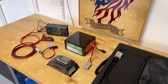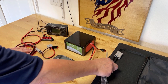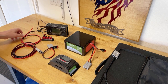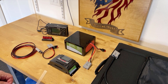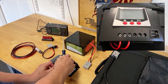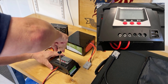We're close to the finish line. We have finished our cables. The first cable that we made will go into the battery terminals on our charge controller and connect to the battery. The second cable that we made will go from the solar panel into the solar panel terminals on the charge controller. Then we'll connect our battery to our distribution block and power our equipment. We want to connect the battery first — let's start with connecting our wires into the terminals of the charge controller. Make sure your polarity is correct, as this is all clearly spelled out on the front panel of the charge controller, which you can see from the photographs.